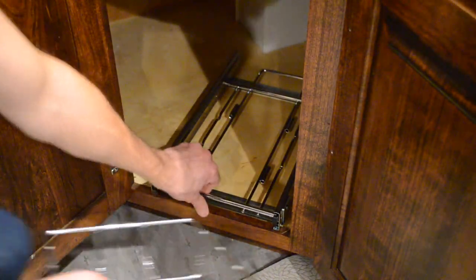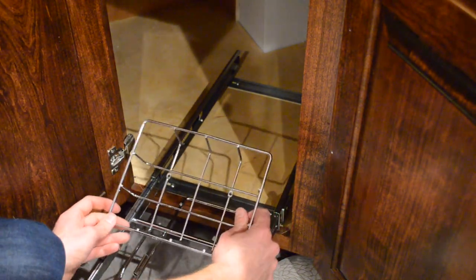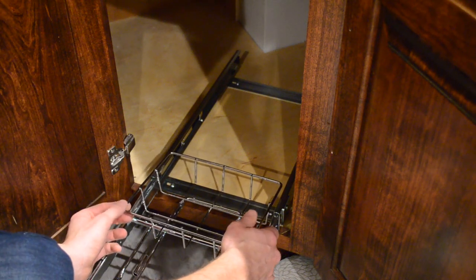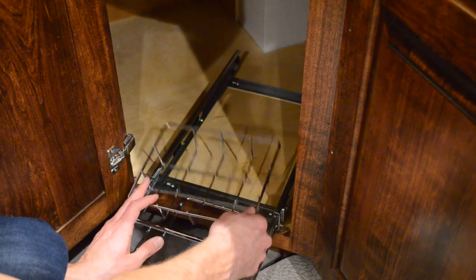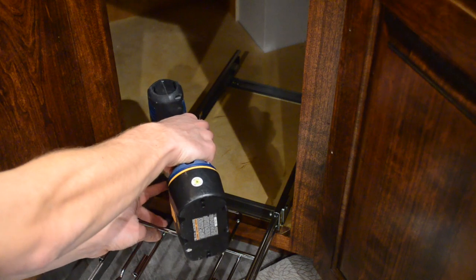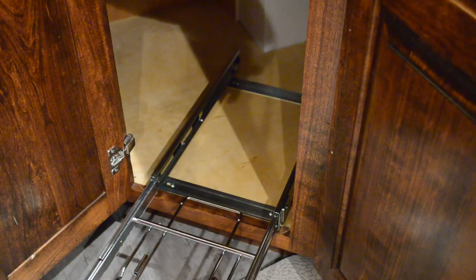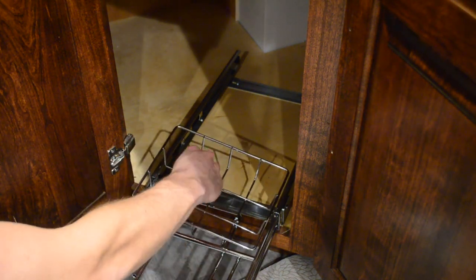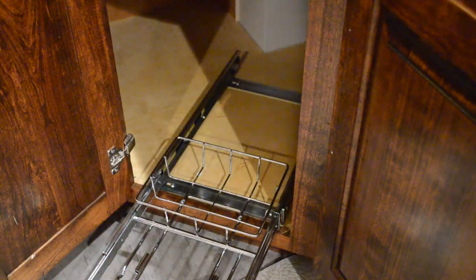The shelf is already secured to the cabinet, and as I'm pulling it out you can see a basket that comes with this model. I'll put links in the description for both models shown earlier. This is where you can put trash bags behind your trash can. For this particular model the screws are already in the shelf itself, so I'm just unscrewing those, placing the shelf down, and re-screwing them in to secure that basket in the back of the pullout shelf.